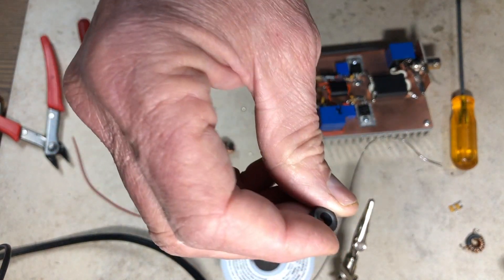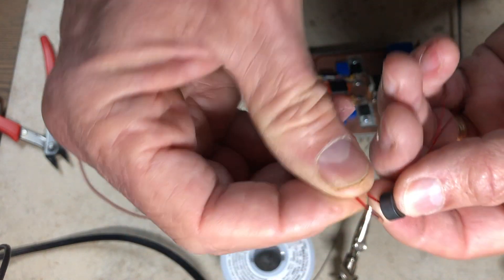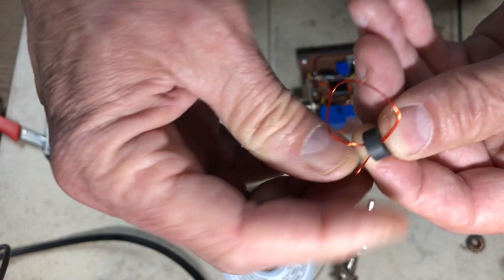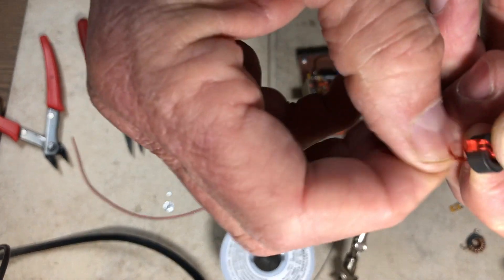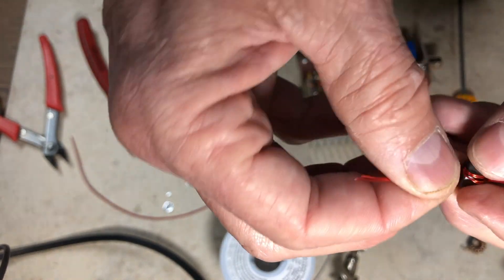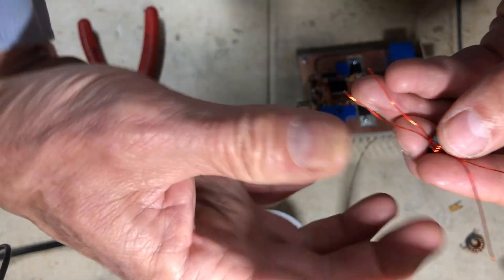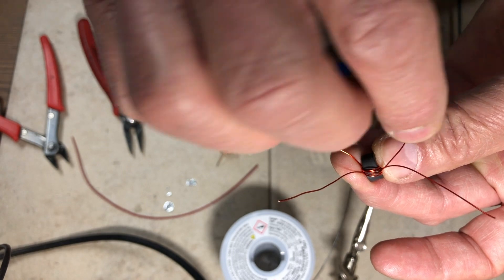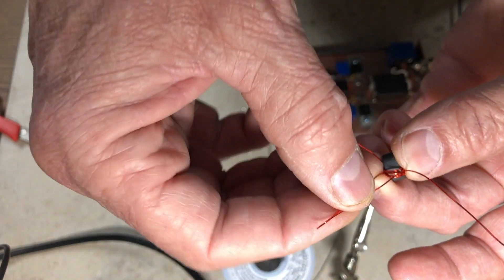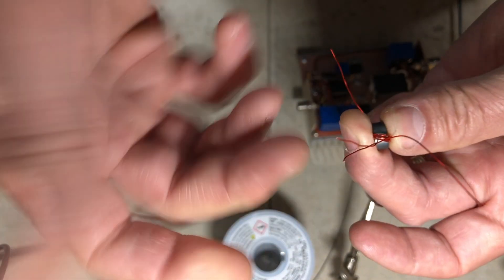When all the turns are on, separate the wire ends, identify which belongs to which winding by continuity, then take one end of each winding diagonally across and twist those two ends together — that twisted pair is your center tap. It's that easy. I didn't have an FT-50-61 toroid as called for in the design, so I stacked two FT-37-61s and it seems to work fine.